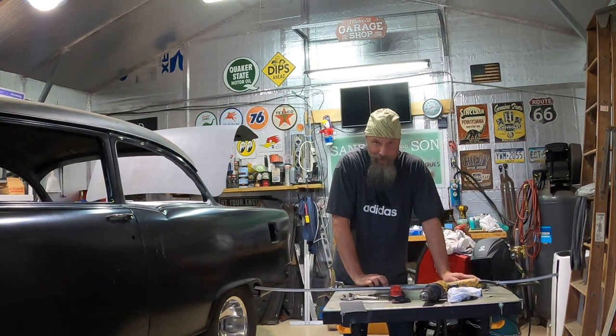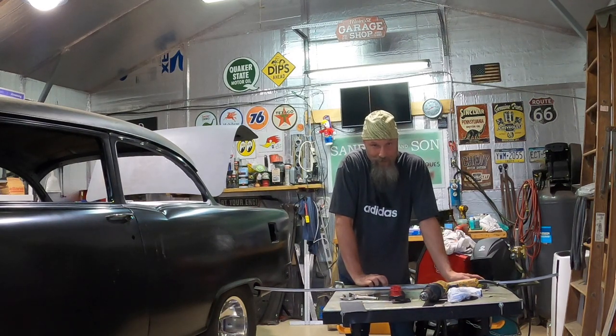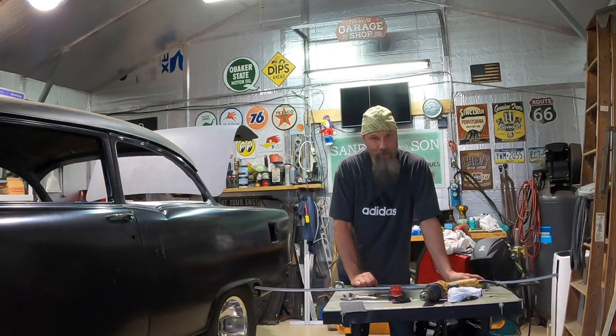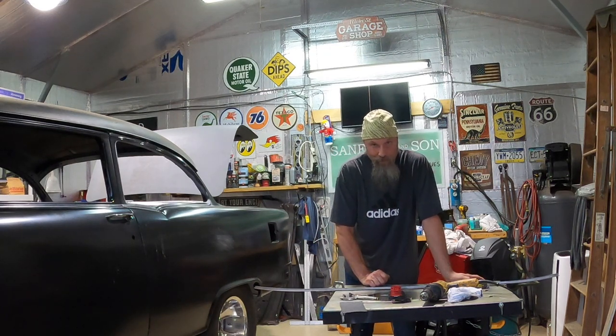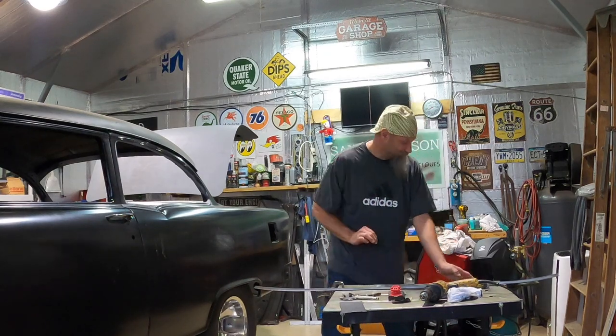The reason I'm drilling instead of using my punch, I'm trying to use a really small bit like we talked about last night. I wanna try that spot weld feature, try to make this nice and neat where I really don't have to do a whole lot of grinding. I'd like to either heli arc them in or just give them that little zap with that spot weld. So that's why I'm using a drill on this application.